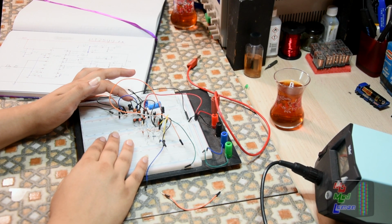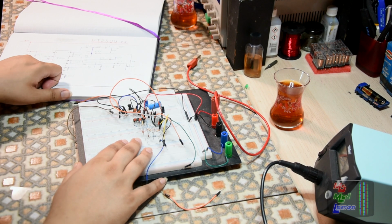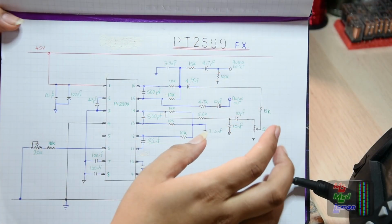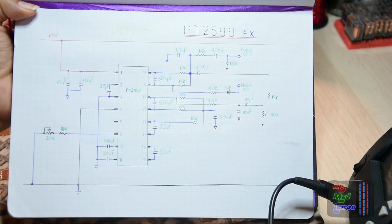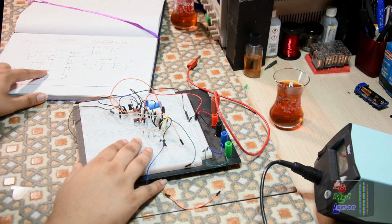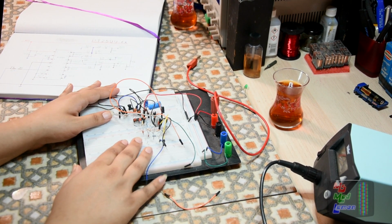So which part of this is digital? It's this. You see, the digital ground is the point ones, and this is the analog ground. So the analog ground is actually not much there. Okay, so pin 3 is digital. Yeah. So that might be your voltage reference then. The pin 2, you mean? Yeah. And the only thing that goes to analog ground is the potentiometer, which controls the delay.